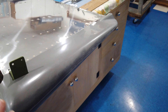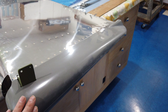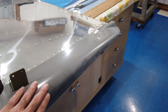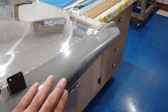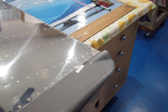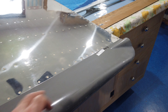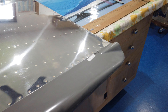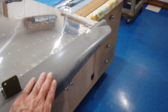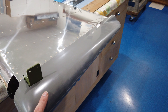I'm still thinking about it, but I don't believe there's any reason I can't go ahead and permanently attach this piece. The next step will be to drill it — I'm assuming you use CS4 countersunk pop rivets — so this will have to be drilled and countersunk. I believe I can go ahead and pop rivet this in place. I'll clean it up real good before putting it on permanently.